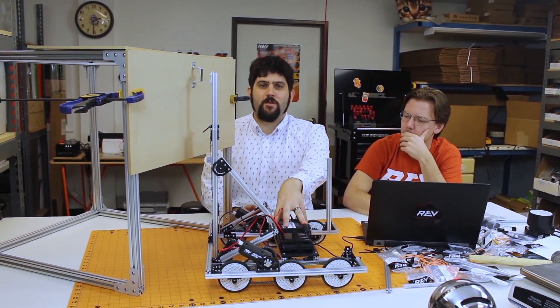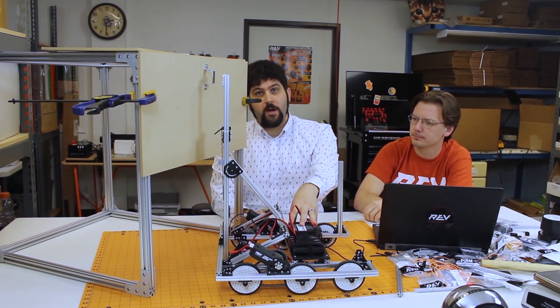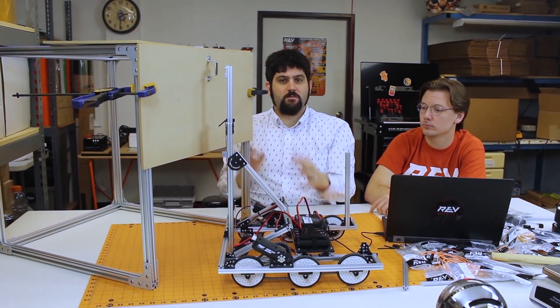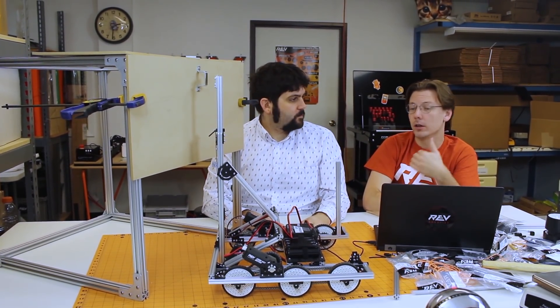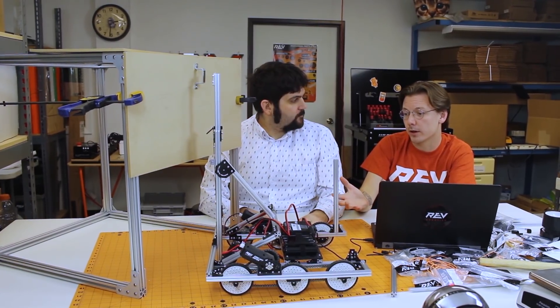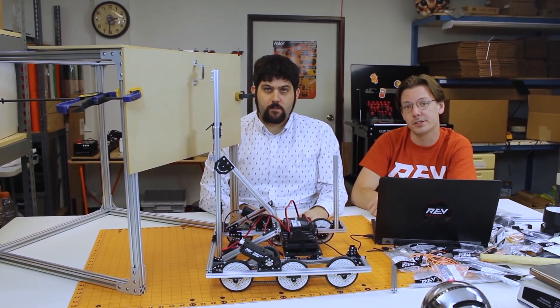We haven't tested this with a 42-pound robot, but if you are going to build a really heavy robot, make sure that you've got enough — that everything is built to that scale of mechanism. One of the big things that you would want to check out is our motor guide. It has a lot of the power information and also talks about how to come up with calculations for how much weight you have within your system, to make sure that you have enough torque so your lift is going to be able to work and be successful on the field.